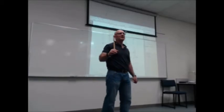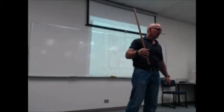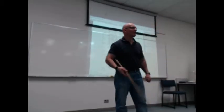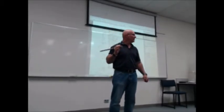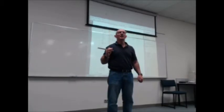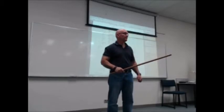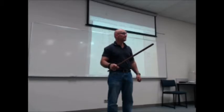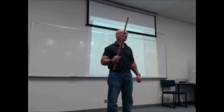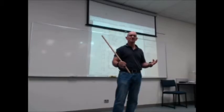Square meter rates, I think it's in your fetch file. Ask questions to painters. What are you charging? What's the going rate? Is it charged by the square meter? You'll probably find it's a square meter price, depending on finish, right? Most of the work these days is just priced on a two-coat system, not three-coat, three-coat being an undercoat and two top coats, because the paint these days is good enough to get away with a two-coat system, depending on the colour.